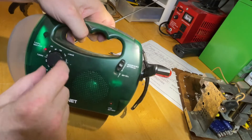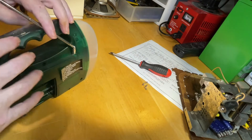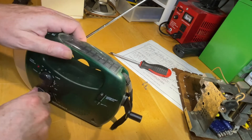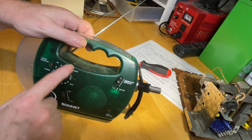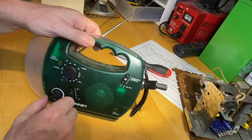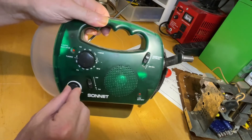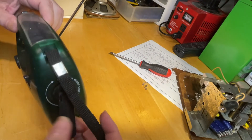One of the problems with it is the antenna broke so it's not a happy camper right now. This connector here, the variable capacitor that does the tuning, is scratchy and doesn't want to maintain a lock, and so is the volume control. Everything's kind of loose and wiggly, so I'm going to tear this thing apart and see what's going on live right now.